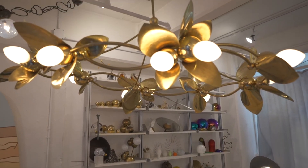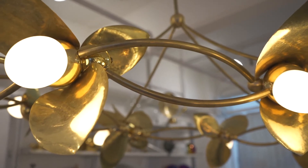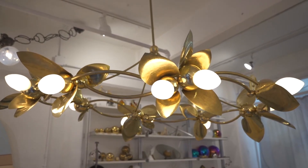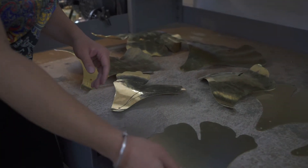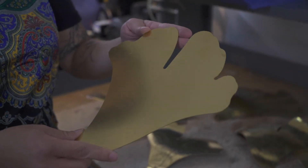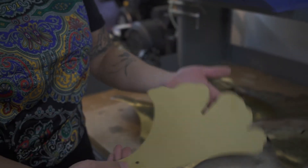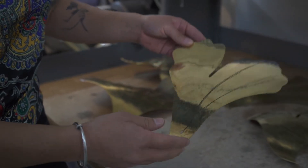This served as the basis for our linear Laurel chandelier, which uses one size module rod and one size leaf. Let's go back to the machine room and look at how we make these leaves. These are the flat leaves that we get water jet cut — they're brass blanks, totally flat — and we form hammer them to shape.